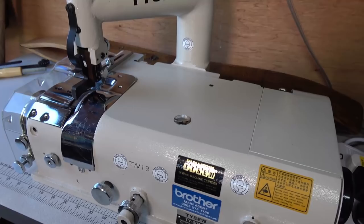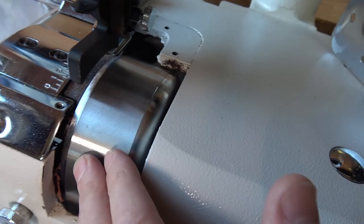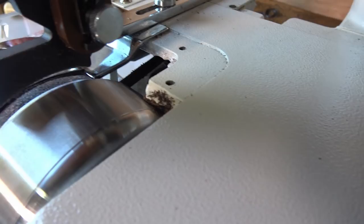The main cutting head is a bell knife — it's a knife that is shaped a bit like a cup on its end or a church bell. If I take the safety guard off, there it is. That shiny outer edge is the cutting edge, and the idea is the leather is fed in, comes underneath this foot, and then gets skived by the cutter.